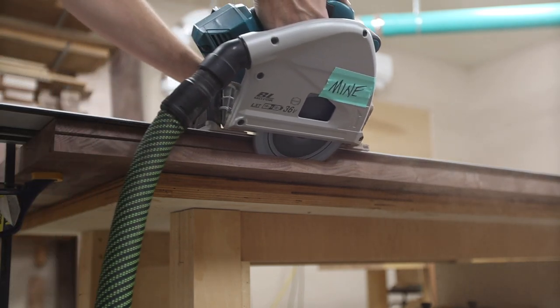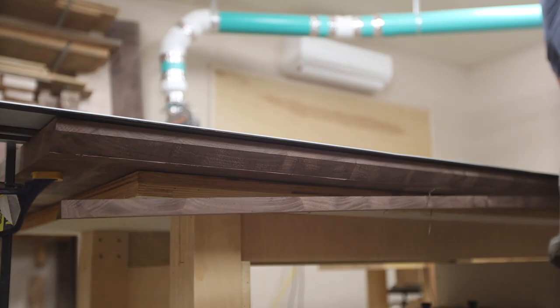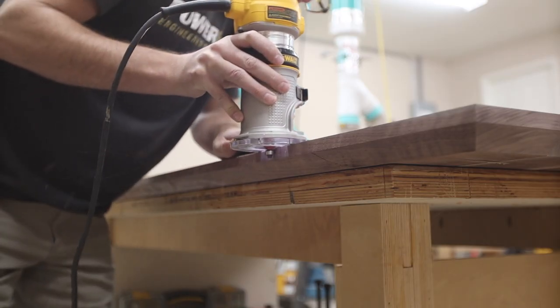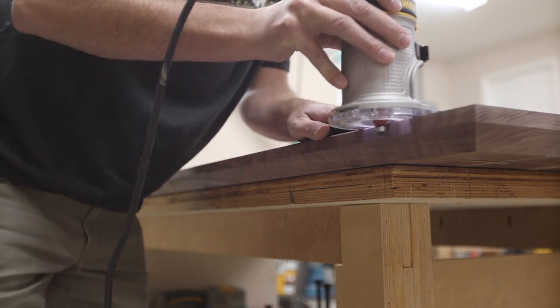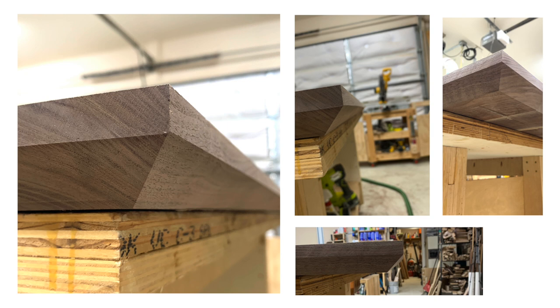I just happen to like the way 45 degrees looks. Having already trimmed the tabletop to the width and length I needed, I found there was not a lot of burning, so it didn't cause me excess sanding. Just look at that profile — I love the way this looks; it gives a really light feel to the edge of a table. So try it out on your next table. If you don't have a router or router bit big enough, just like I didn't, grab your track saw, get to work, and enjoy.